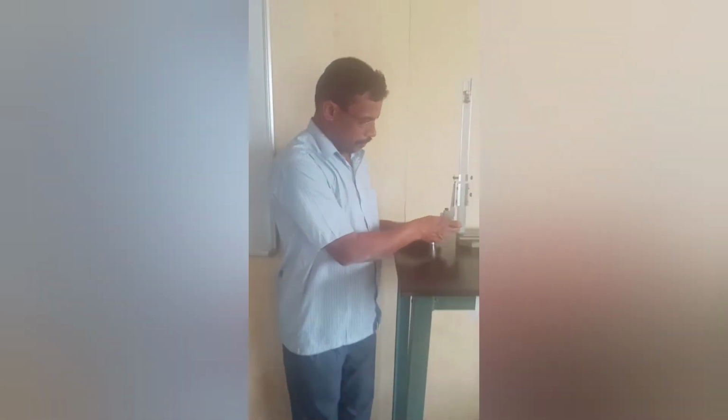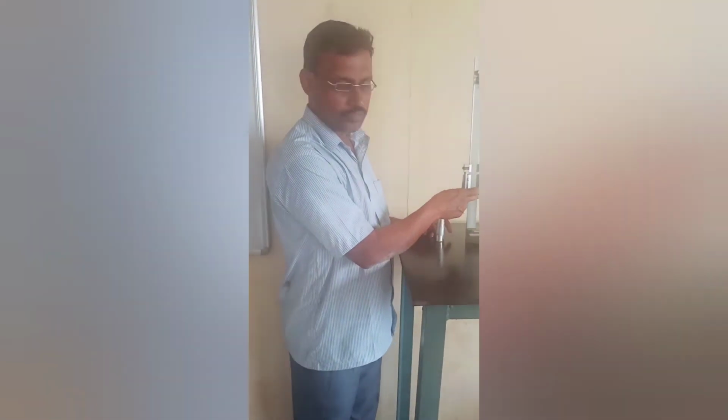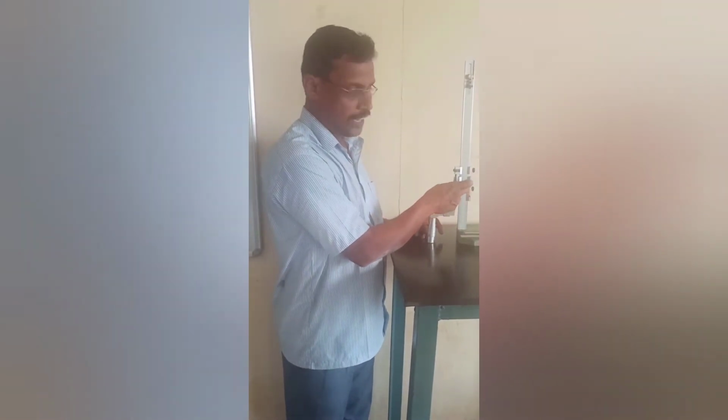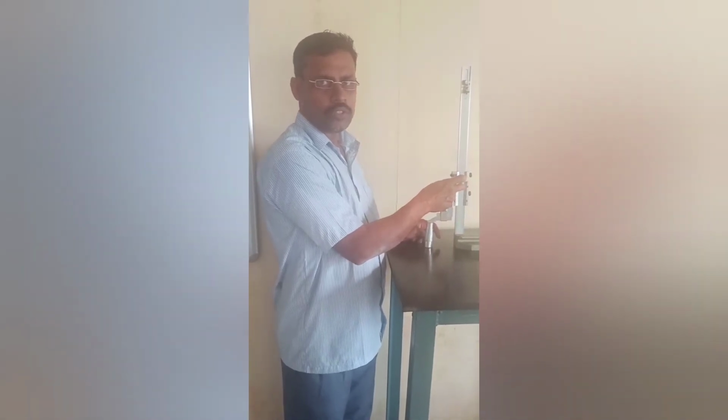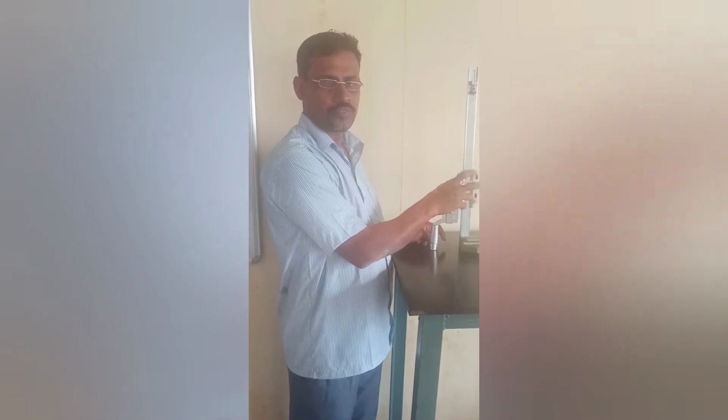Now, what is that reading? Total reading, sir? Total is main scale reading plus vernier scale reading into least count 0.02 mm. Okay, that's the answer.